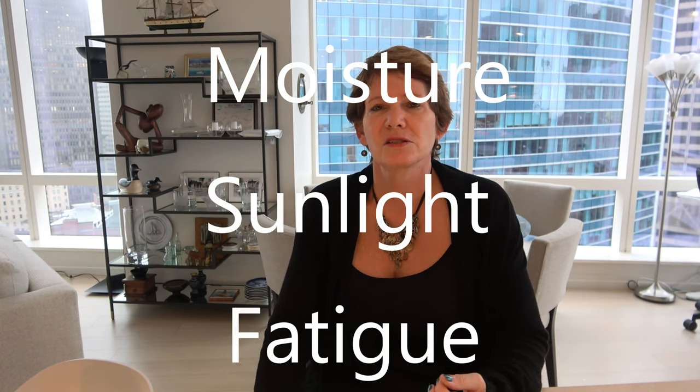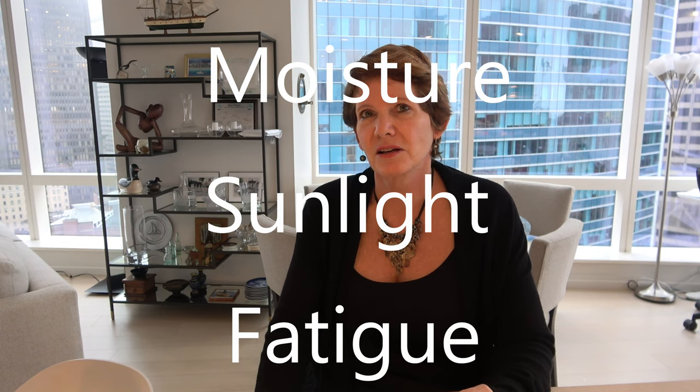The factors that will affect sail life are moisture, sunlight, and fatigue. And what will happen with a composite sail is, rather than getting all stretchy and blown out, it will tend to delaminate. The other thing that can reduce sail life is flogging of the sail. So never let your sail just flap in the wind. I think all sailors know that. Pierre is expert at setting sails, so our sails are never flogging in the wind.